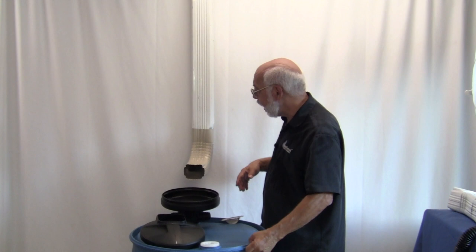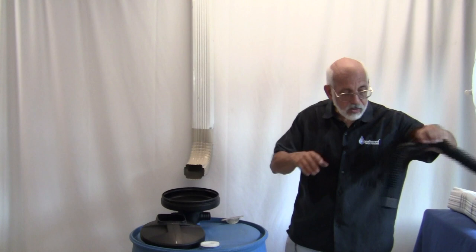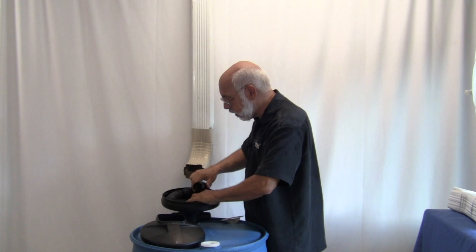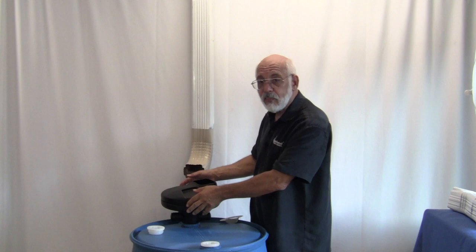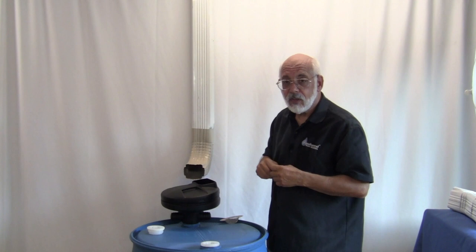Winterization would be to pull it out of the way. Undo your elbow, put your piece of straight pipe back in place, put your elbow back at the bottom, and now you're back in business. You've emptied out your 55 gallon drum. We've put our piece of hose that will snug back up inside of the UFO Rainwater Harvesting Unit, so it has a place to live and doesn't get lost. Put the lid on the unit and now all of our pieces are together. We can leave it installed like this if it's in a great location, or you can unspin it and put it somewhere else. That's how simple it is to bring water from a valley or from a downpipe into the unit.